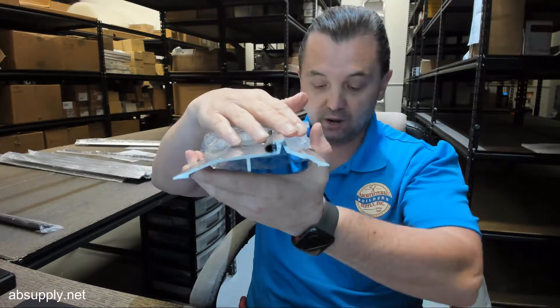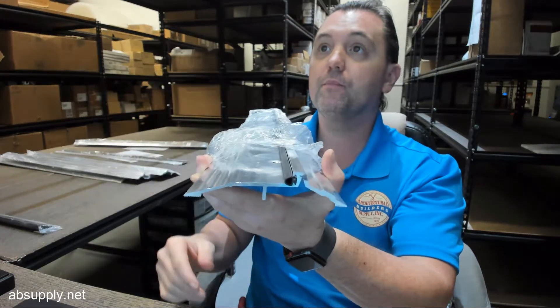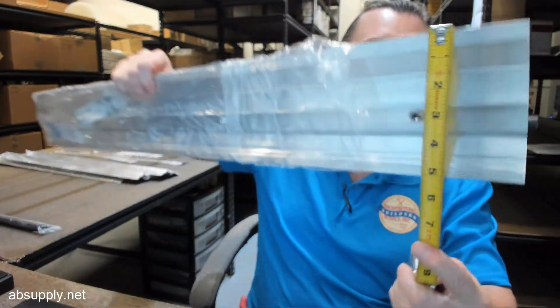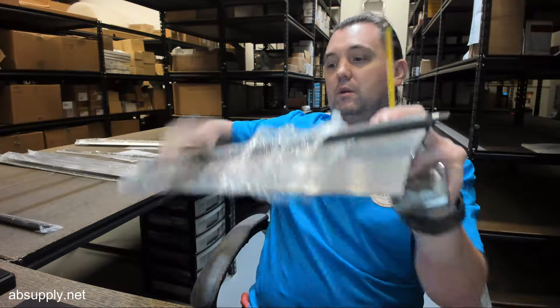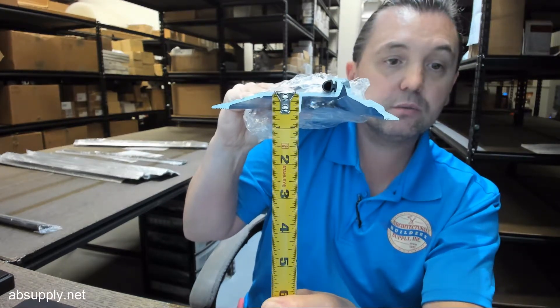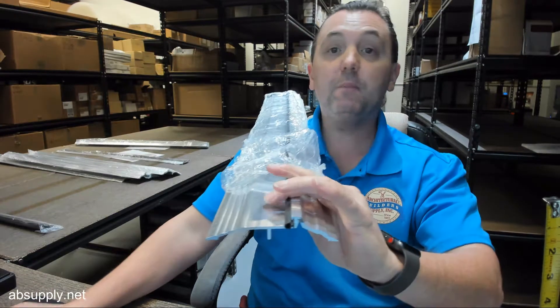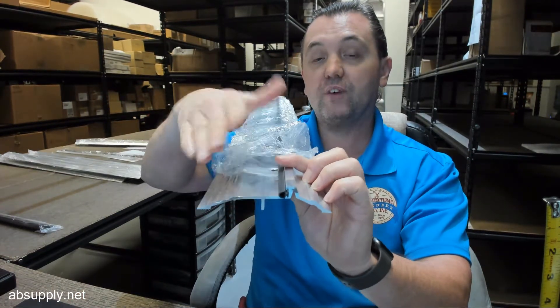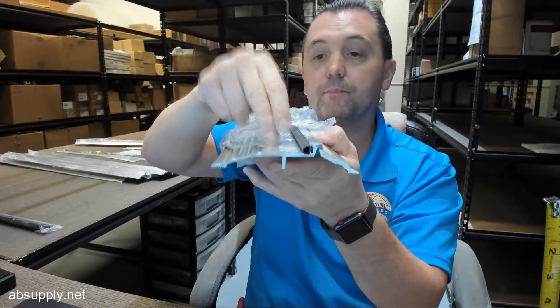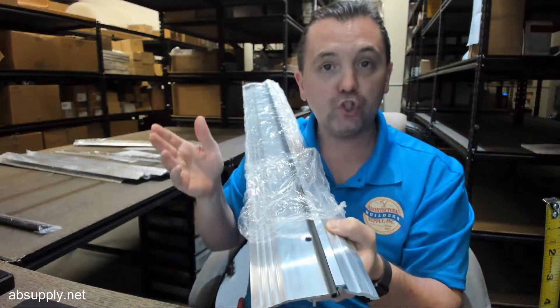The dimensional properties of the 803N are: five inches wide, one inch overall height — which is obviously not handicap compliant — and then five-eighths of an inch down in the area that will be immediately under the door. If you've got a three-quarter inch undercut, this should just gracefully fit and bump up against the bumper seal. Out-swinging doors generally are where you'll see these, largely because that's where hollow metal doors appear in many different applications.